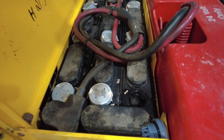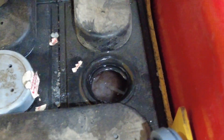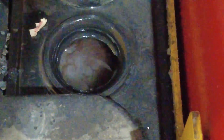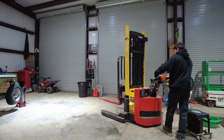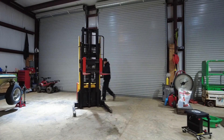When you get those opened up, they should be full of water. Mine have some white crystals in there, and I believe that's from not having water in them. So these batteries are not 100% and they never will be, but for the little amount I use this forklift, it works great. I can still run it for a couple of hours now without having to recharge.